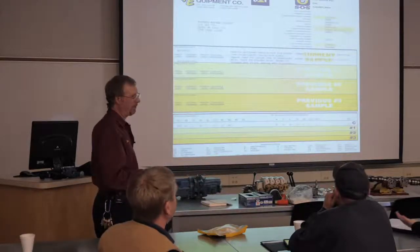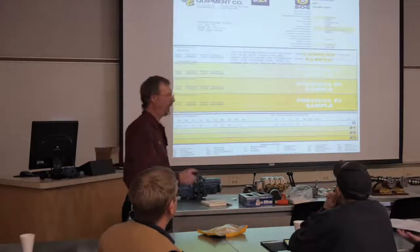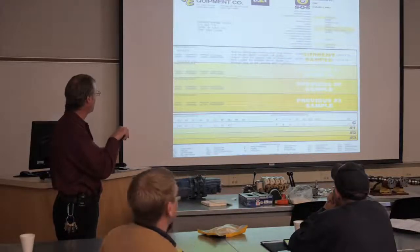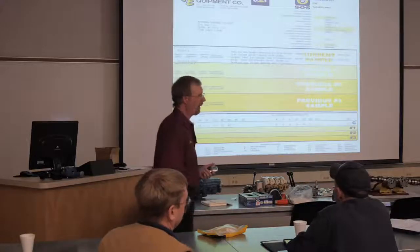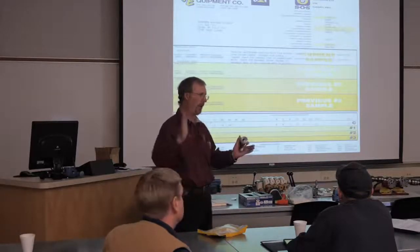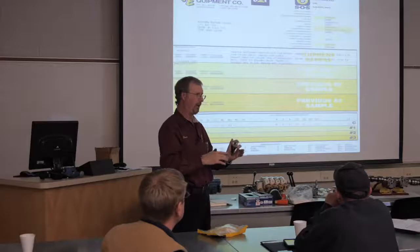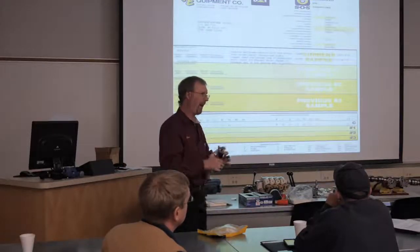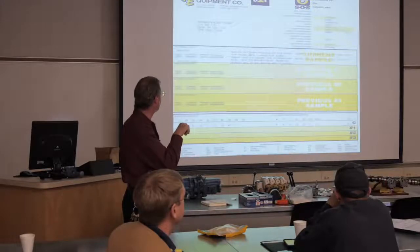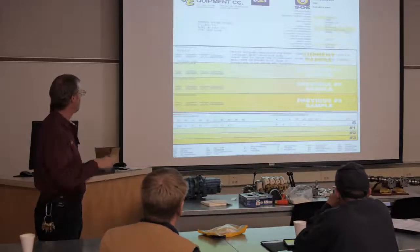The first sentence on this report is engine oil - correct. If you don't know how to read these, it can be confusing. 'Positive antifreeze reaction with high sodium' - when they do the test, the sample is brought to very high temperature and sprayed through light. It's FTIR - Fourier Transform Infrared - and the way the light bounces back gives different color spectrums. Different elements give different colors. High sodium came back, along with silicon, which led them to believe antifreeze is present in the oil.